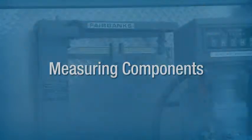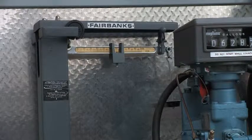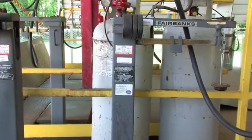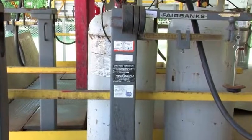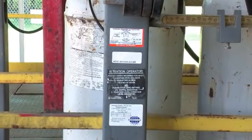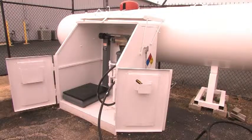Platform balance beam scales determine when the proper filling weight for cylinders is reached and when to stop the flow of propane into the cylinder. Platform scales can be single beam, double beam, or digital, and all require periodic maintenance and should be checked for accuracy based on the manufacturer's instructions. In many states and jurisdictions, scales must have certification decals from weights and measures officials and be inspected periodically and calibrated for accuracy. Scales must also be leveled and protected from weather, especially accumulation of water, debris, snow, or ice.